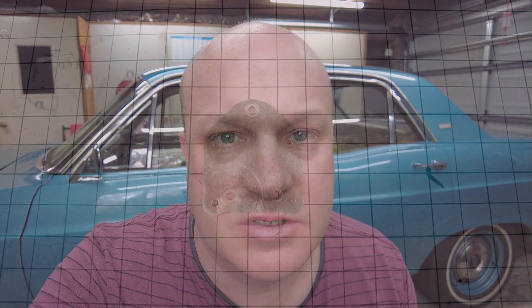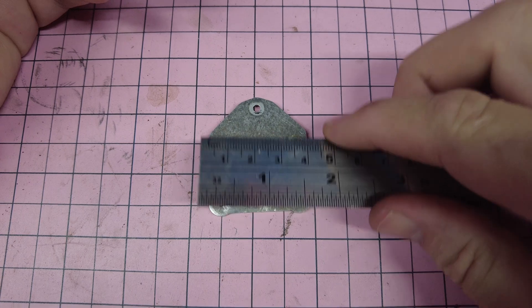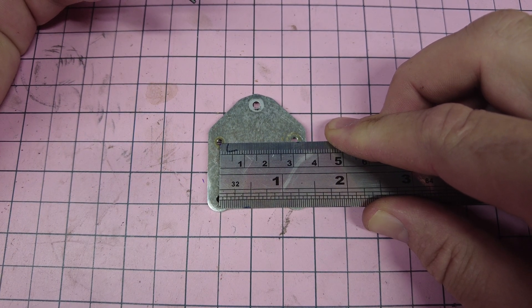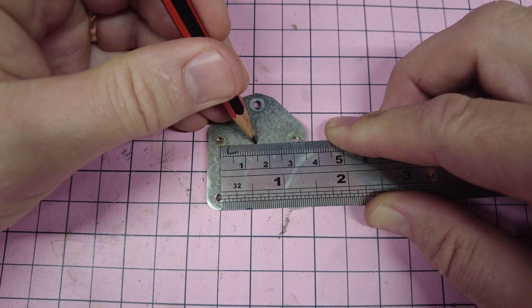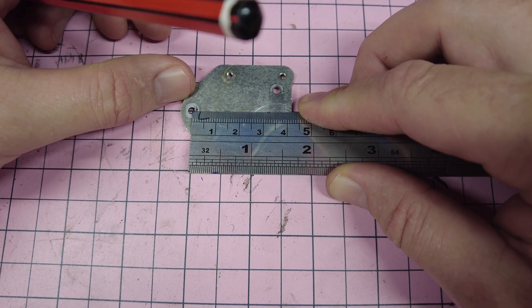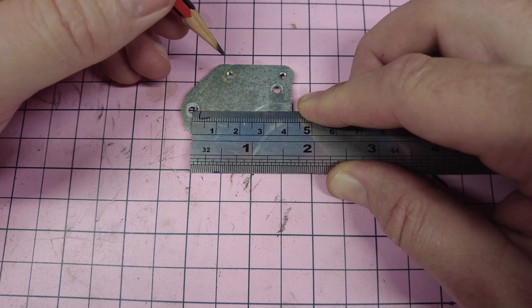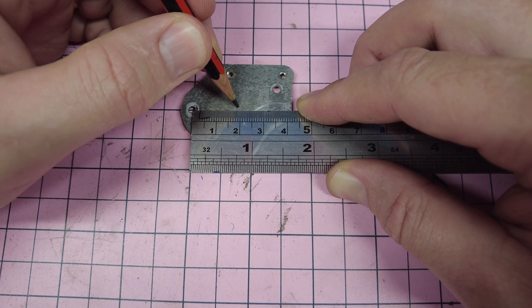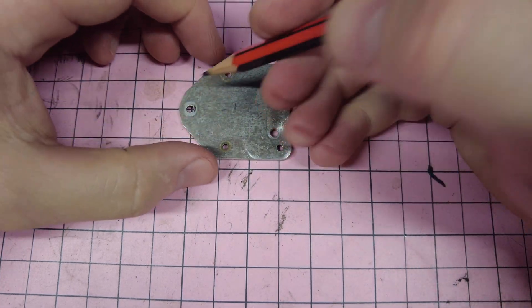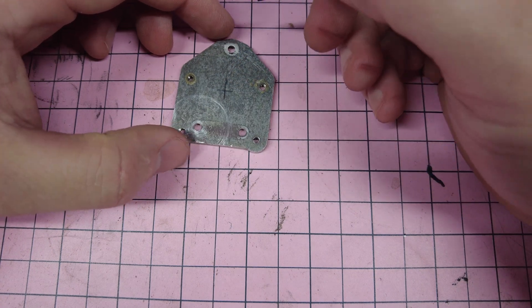It is however big enough to warrant pilot drilling. To begin with, I'm just going to mark the location of the hole with a pencil. I want to go roughly in the middle of those two holes there, which are about 30mm apart, so I'm going to draw a line here at 15mm. I also want to go between centres here — I've got 35mm there, so half of 35 is 17.5mm. Where these two lines intersect, that's where I want to drill my hole.